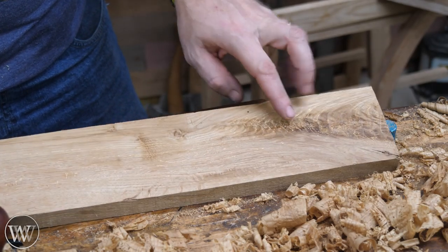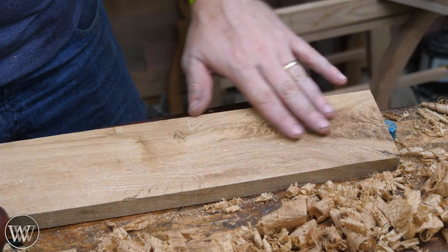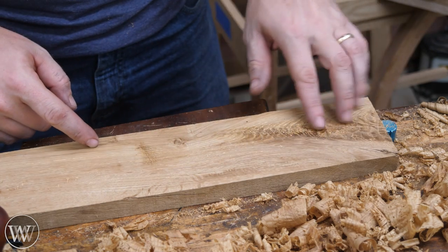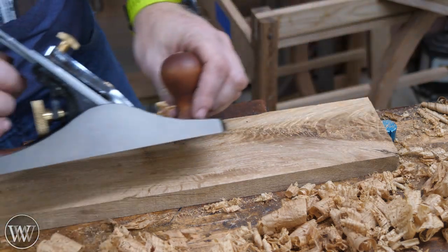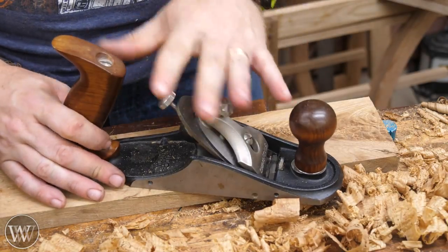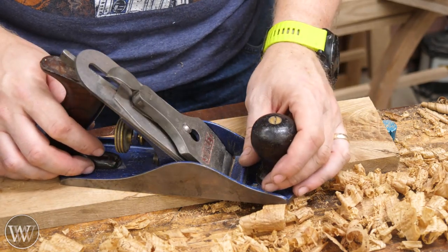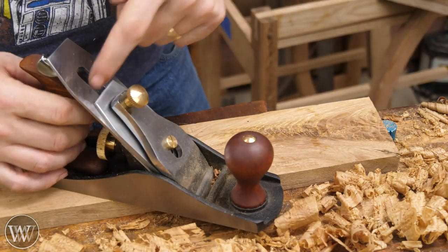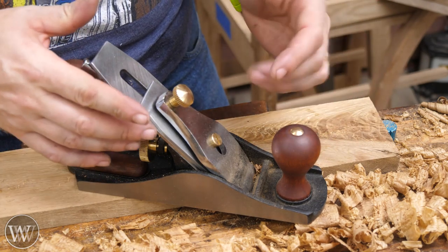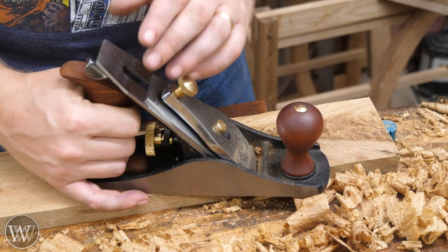Here you can see the wood and how smooth it is. I'm very, very pleased with how this came out. There's a little bit of tear out still down here — I have to go about an eighth inch more to get down to that because the last plane chewed it up — but all the rest of this is absolutely gorgeous, especially with the curl and the swirl and the switching grains. Most of it I'm actually planing against the grain. You can see how when you take your time and set it up well, even with a relatively affordable plane you can do a nice job. Whether you're doing this with a low-end good-quality new plane, a high-end professional plane, or an antique, it's all going to be the exact same setup. They're all going to do the exact same work once you take the time to tune them up.